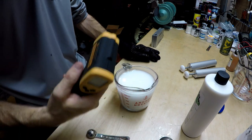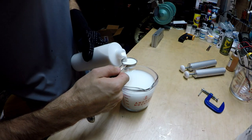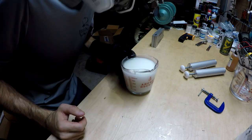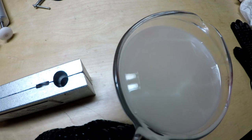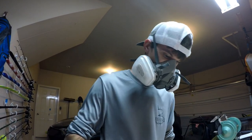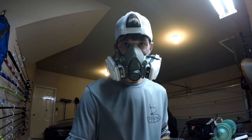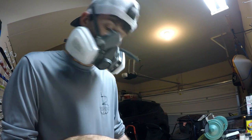We're at 233°F after another minute and a half, so we're about a hundred degrees off. I've already shaken the hardener up really well and I'm adding three measures now. Let's go another minute and a half. You should see this — it's not white anymore, it's starting to marble. We need to stir that up and it will continue to get clearer and clearer. Also it's not watery anymore, it's actually getting thicker. Let's give it a little stir and check the temperature — we're only at 261, so we've got a little ways to go.